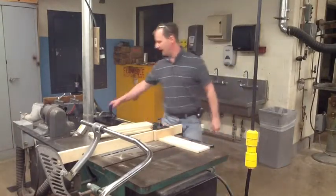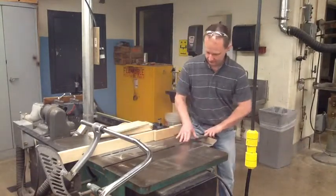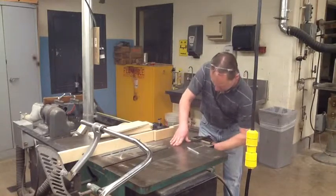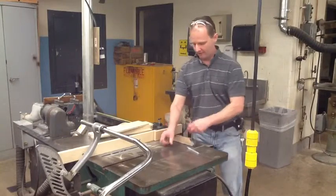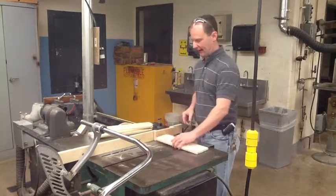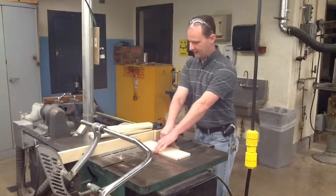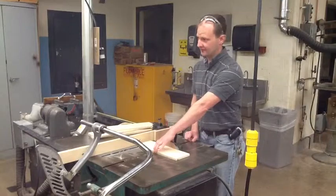Now, I can grab my miter gauge, go ahead, square it up, so I'll slide it in the groove here. Loosen it up, re-clamp it, flip it back over. I now have it squared away. Now I can go ahead and take my side with the dado down, place it against, and you can see as I come off, I'm no longer up against the fence.